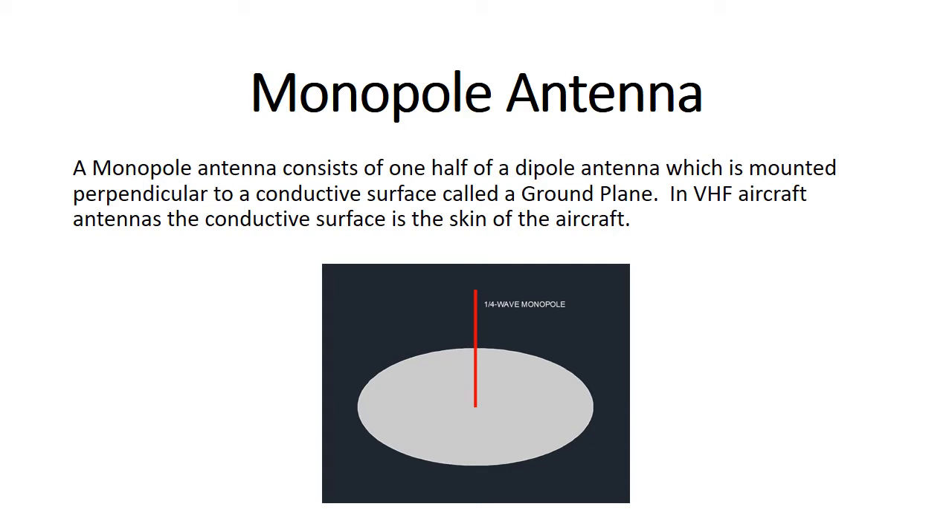With these aircraft antennas that we use, they're designed to mount on fixed-wing aircraft with aluminum skins, and the skin of the aircraft acts as that conductive surface — that's the ground plane. Theory says that ground plane must be at least one quarter wavelength in radius. At the frequencies we're working with, a quarter wavelength is 23 inches — that's the length of your antenna, it's a quarter wave monopole. So the ground plane in theory should have a radius of 23 inches, or a diameter of 46 inches, which is going to be a little difficult to deal with since the frame is only 14 inches wide in the area where the antenna is going to be mounted. To further complicate things, in theory the monopole is always perpendicular to the ground plane, but in our case it's slanted, so obviously we're going to have to make some compromises.